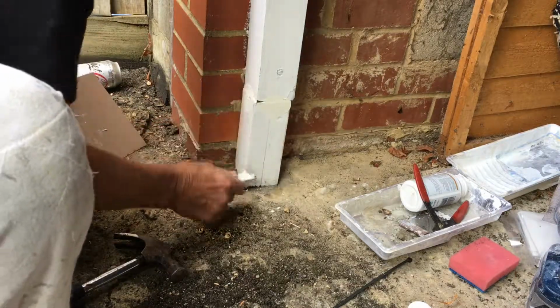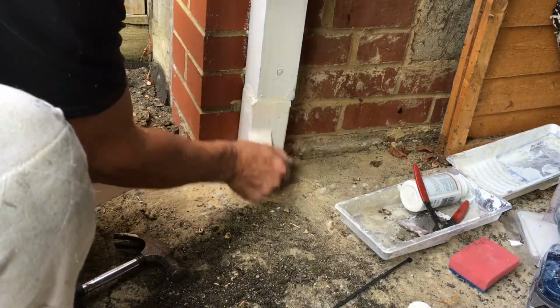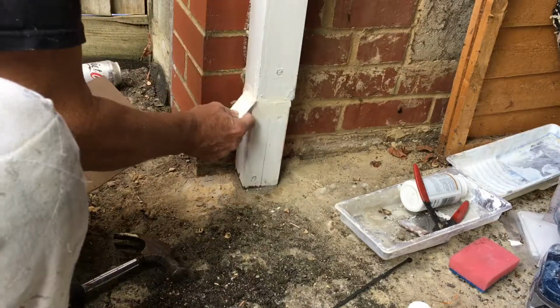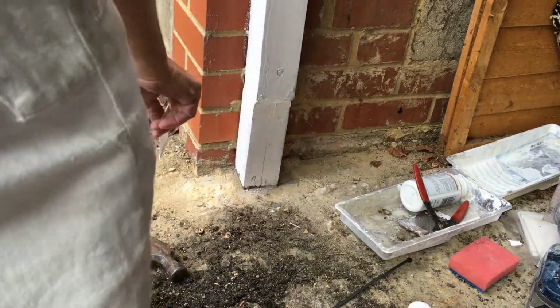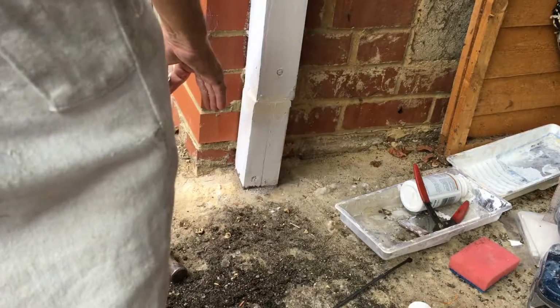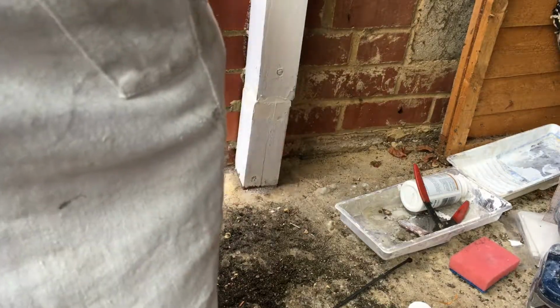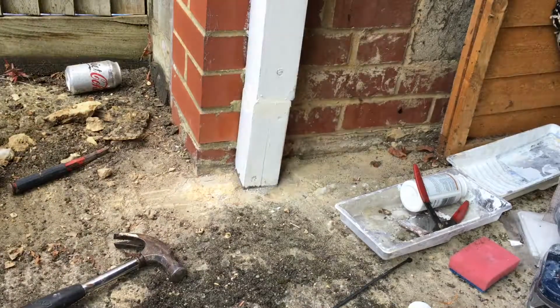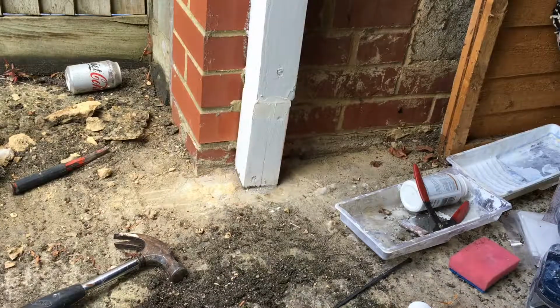So I've done some modifications to the driveway here a little bit. I don't know whoever did it, but when they did this, they left a big pile of concrete right here. And so any water that came had nowhere to go except right on that post. So I've just made a little channel for the water to get away from it. Good idea. Same thing over there. Good idea. I mean, it looked like they tried to do something, but they sort of spilled it, yeah, right there. And it was just in here. That's why you probably lost your first ones.